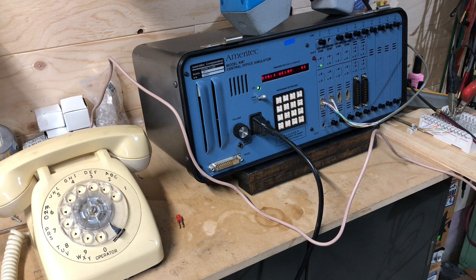I don't want to call it a PBX because it's more capable. You can set up seven-digit dial plans on it. It supports all sorts of stuff around modifying the tones, durations of the tones, and signal timings. It's like a little PBX but you can configure the crap out of it using a very obscure little LED and keypad interface.